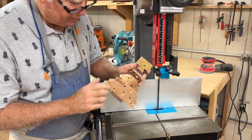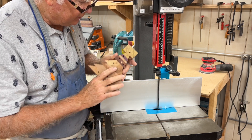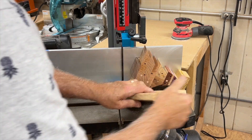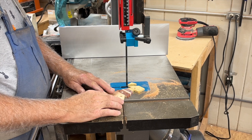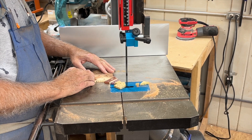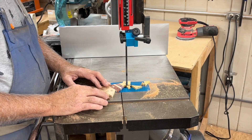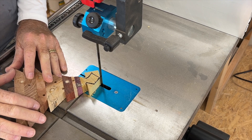Now I'm going to cut my quarter-inch slices off this loaf. I've got all my dowels in here and little holes for the stars, and my blade is set to a quarter-inch. I work at cutting the star — or diamond or whatever shape you want — at the top as the final cut on the bandsaw, because I wanted to leave enough wood on there as I cut out the loaf, since I was afraid it might break off. You can use a different shape, and I'll show you a second one. Because these are a quarter-inch thick, they do have a tendency to break if you drop them, so make sure you get enough glue in there, or glue them back together after the break.